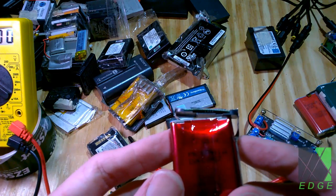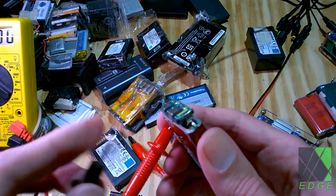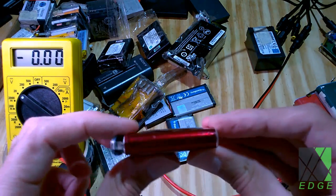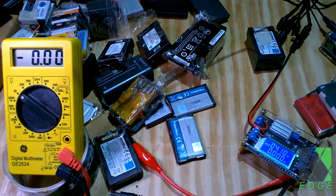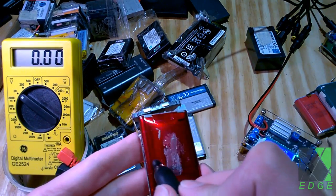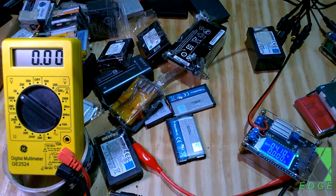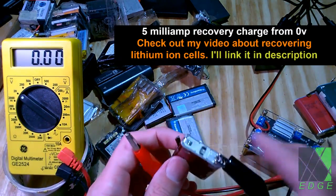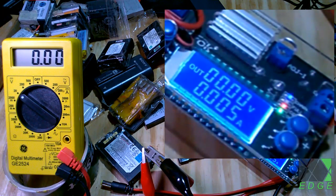The time to identify polarity is really before tearing it apart and ripping off the circuitry. I have another battery here that's badly bulging, but I can use it for identifying polarity. It turns out it's not completely dead — the positive is actually on this side. Even though it's bulging, it's got a charge in it at 0.86 volts. So now I can go ahead and mark negative on this side and positive on that side, and do the same for the other cell before charging it. You don't want to reverse charge a dead battery because after that it'll probably be ruined. I'm only putting about 5 milliamps into it.